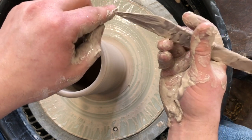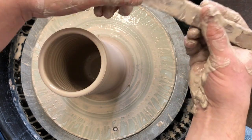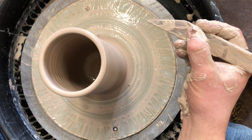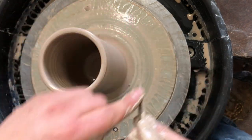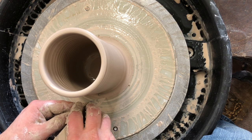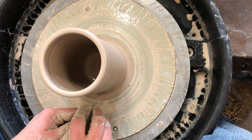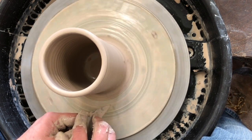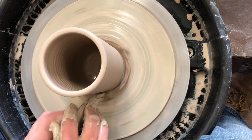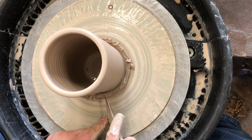I've got the sharp edge facing up. Hold it like a pencil — what I mean is you're gripping it like a writing utensil with the blade part up. I'm gonna hold it right at six o'clock, twist it this way a little bit, and angle it so that the tip is the last part that would hit. I spin the wheel and it's gonna make a snowbank on the outside.